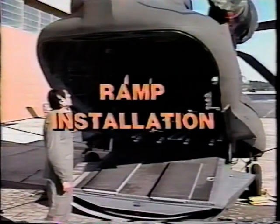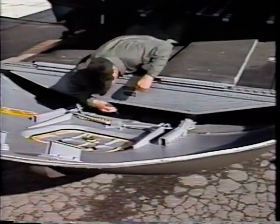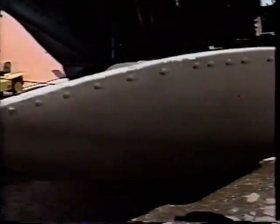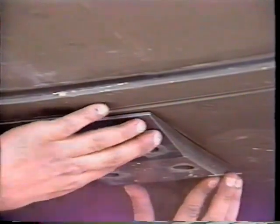To begin installation of HICKS on the aircraft ramp, extend the ramp tongue. One person must then clean the screw heads, if required, of the four screws that attach the center skid pad and hold the screwdriver while resting on the ramp floor. At the same time, a second person must be under the ramp using a suitable wrench to remove the nut securing the center skid pad. Remove the bottom center skid pad and attach the replacement ramp skid pad on the underside of the ramp.